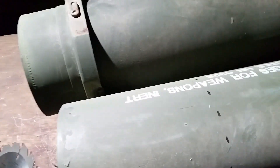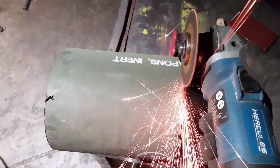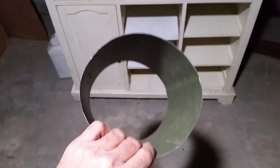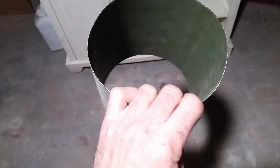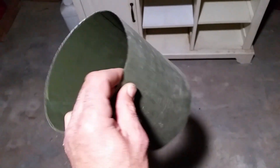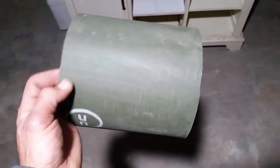Cut out a feeder tube and an exit port tube on the back. This is the section I cut out of that cylinder. We're going to weld steel plate on this side and steel plate across the other side. Put dead-center holes in there, hollowed out, so we can put bearings on the outside for the shaft that's going to have all the blades on it to run through. Let's move on to the next step.